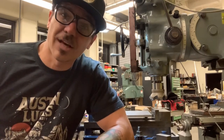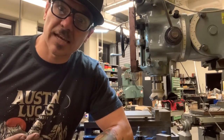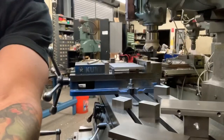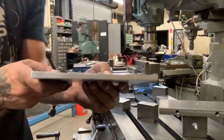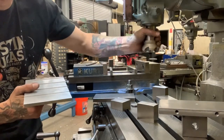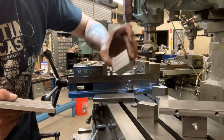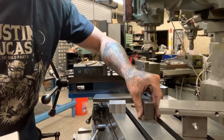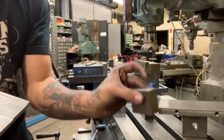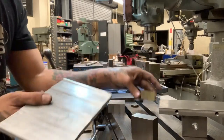In retrospect I probably should have just set them up individually and cut them one at a time — but I over-complicate everything. So here's what I built: a plate with a bunch of different angles cut in it. All those tenons will be stacked on it and go into my mill, where this big face cutter with six octagonal inserts will fly-cut all of them to the same angle. That way I'll have 12 done, and every time I want to do more I can just set pieces of metal in and knock them out. You start by cutting them to about the right size, then mill both sides to a known size so there's just a little bit to shave off the top.